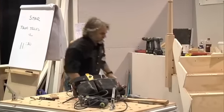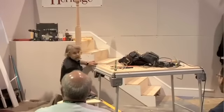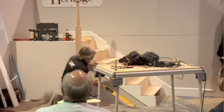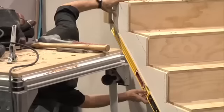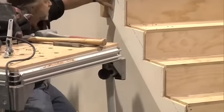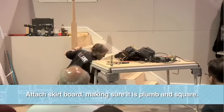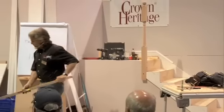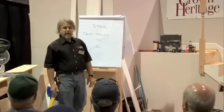I'm going to make sure that my skirt board is on here at the correct pitch for the stair, which I figured out with my calculator to be 36.7 degrees. I'm going to use a digital level here to do that. It's very important to try to make everything plumb and square, and then try to use all the angles the same, because I'm going to use my theoretical pitch of the stair to do a lot of my cutting and save those expensive trips back to the chop saw.